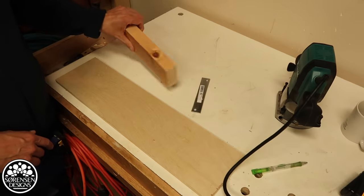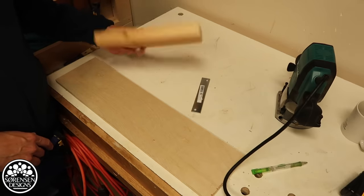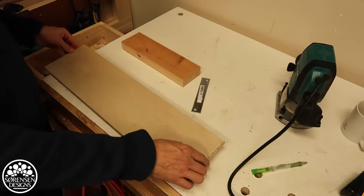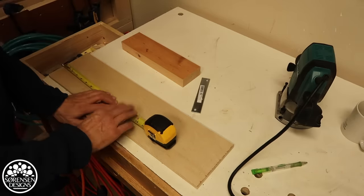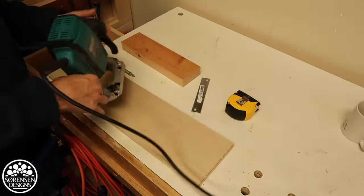The main components for this jig are: the two mending plates I drilled a center hole through, some scrap wood — this is a one-and-a-half-inch block of fir — and some half-inch plywood. This jig will be 6 inches by 12 inches in length. And of course you need a plunge router.